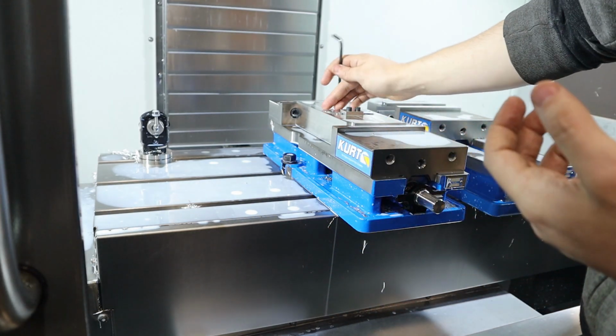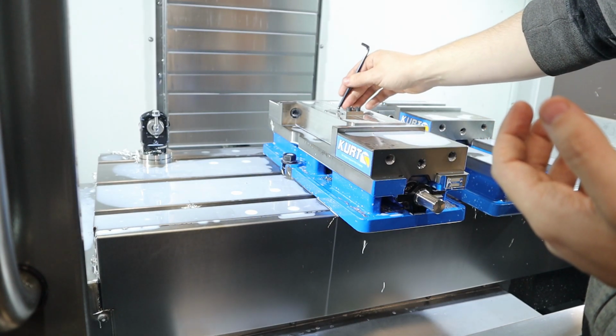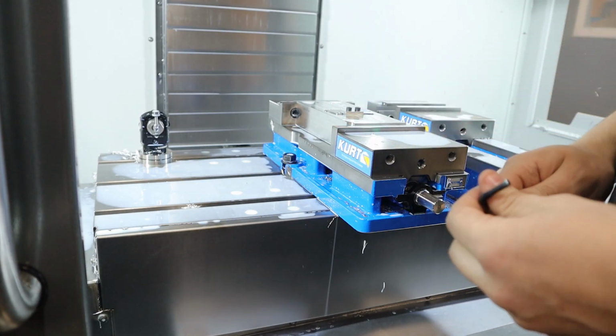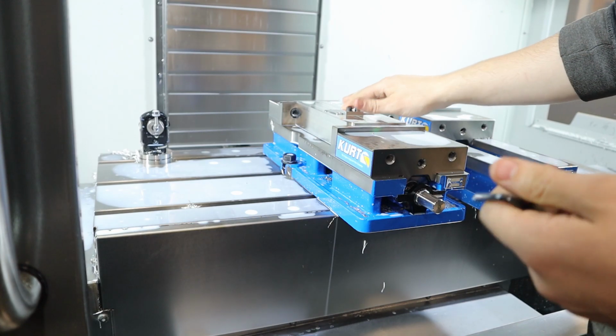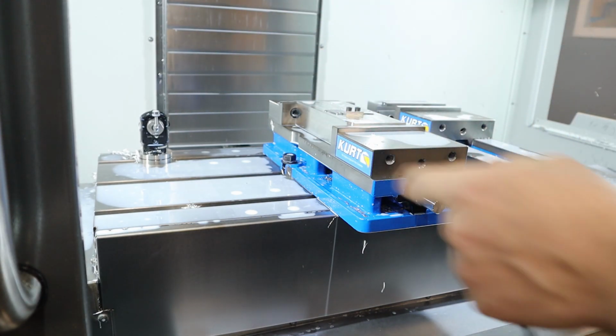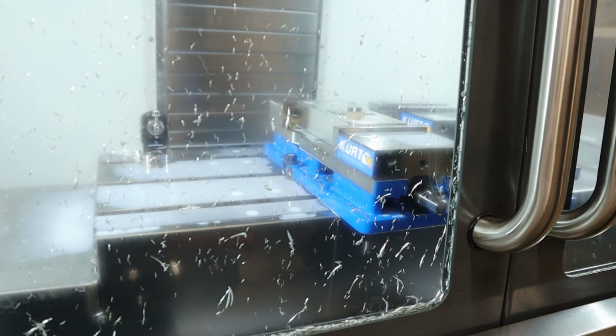And then it's going to do an adaptive to cut the majority of the blade section, whatever you want to call it, and then it's going to come steep and shallow with the ball end mill. So we'll see. And nothing hits in simulation, but we all know how that works. So yeah, let's do it. Contact!